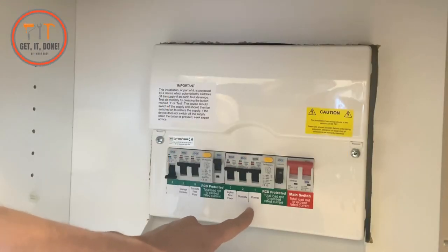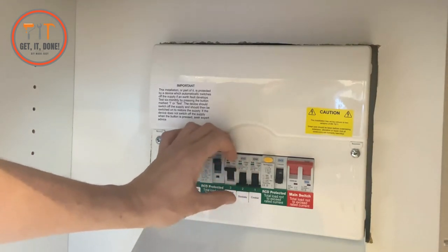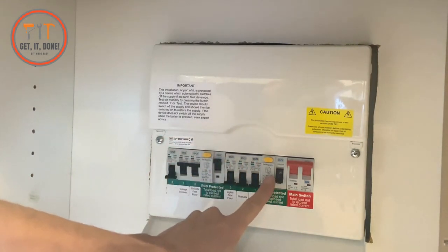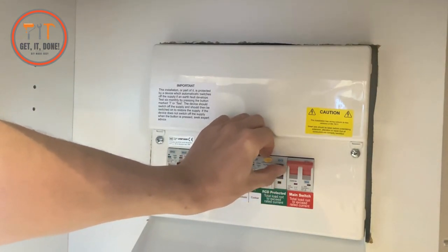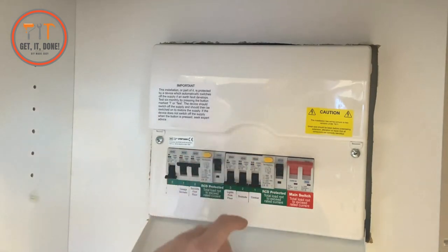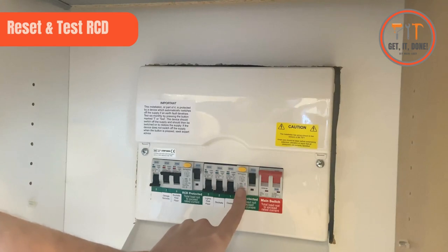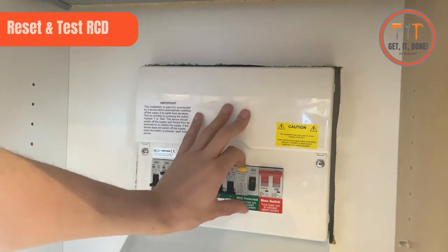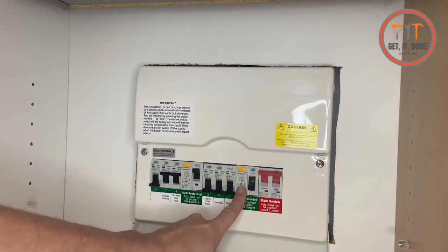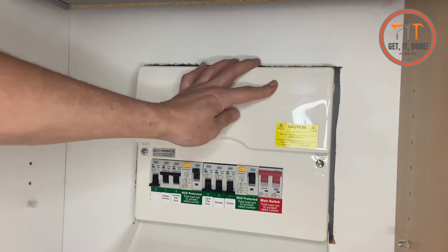What I'm going to do now is turn off each of these breakers which this RCD is controlling. I'm then going to re-energize the RCD — that's step one — to make sure that this RCD is actually holding in the on position. What that tells us is that this RCD is working, and if we push the test button it's functioning correctly. It's tripping for a reason — the fault isn't the RCD, and to be honest with you it hardly ever is.